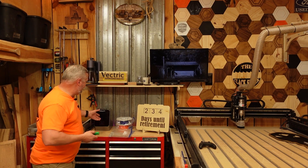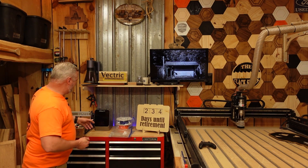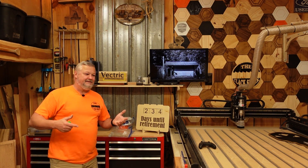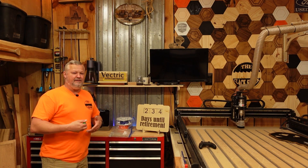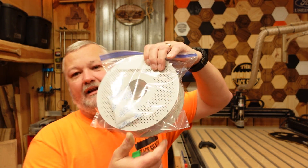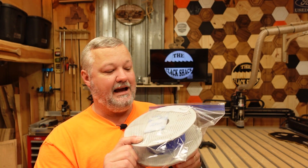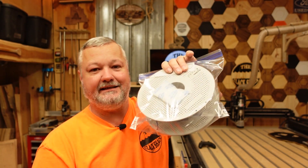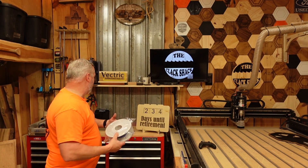It's got a couple of fans in there, similar to a computer. It does heat up - right now it's at 50 degrees Celsius, 34% relative humidity. I usually do them in a few cycles because I'm not going through that many rolls. I've dried these for the past two days for a couple of hours here and there. I also have some silica that comes with everything you buy. I put it in the dryer with the filament, which lets me dry the filament and reuse my silica beads at the same time. Once I get it dry, I put it in a Ziploc and drop those silica beads in there, which keeps it dry enough that we don't have a problem with 3D printing.